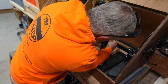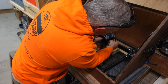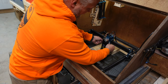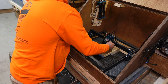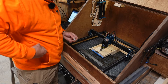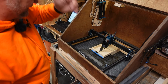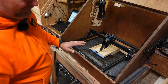I'm not sure if any of my machines is going to be able to pull this off without hitting. I think I'm going to have to reset my depth using these screws - basically just take the screws out and move them up higher. That is one thing this machine is really good about: the range of movement you can get out of the Z axis without having to put legs under it or space it up. There's where my focus needs to be, but that's going to be way lower than the top of the box. The only options I have are: one, take the air assist off completely, or two, just try to stay inside the box.